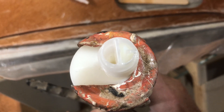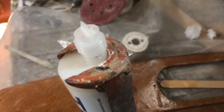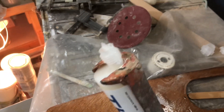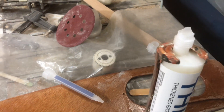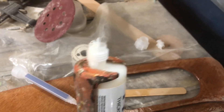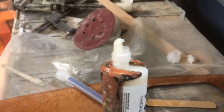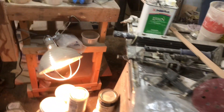So if you put that through your caulk gun extension mixer, you're not going to get a good mix. Sometimes what you have to do is waste a bunch of product so they're both coming out at the same time and they'll mix properly. It's kind of hard to do this one-handed, but look how much of this product I'm wasting.